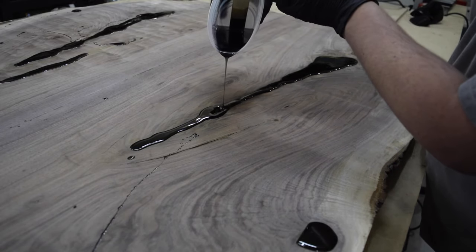Finally, it was time to apply my mark. I'm attaching the base using threaded inserts. I've placed the base in the center of the table and drilled in some pilot holes. I use a bolt and some washers to insert the threaded inserts — I find this to be the easiest way to get them installed. With the base securely attached to the center of the table, I could finish putting in the hardware.